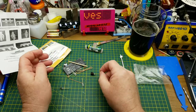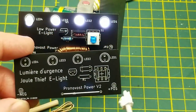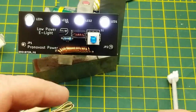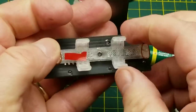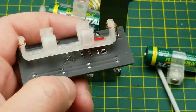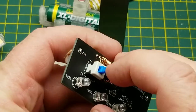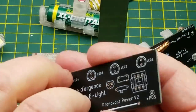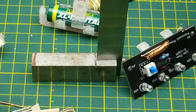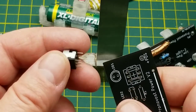The differences Pat notes are on the circuit board, not the circuit itself. The silkscreen is different — one important improvement is he's got the positive and negative marked there, which is good. That was a confusion I had in the previous version — I solved it by putting a piece of red electrical tape on there. The other problem on the original was a solder bridge I had to add because the switch wasn't working properly. On this one he's fixed the tracks so that two sections of the double-pole double-throw switch are both used, doubling up the contacts so if you get a duff switch you've got a second chance.